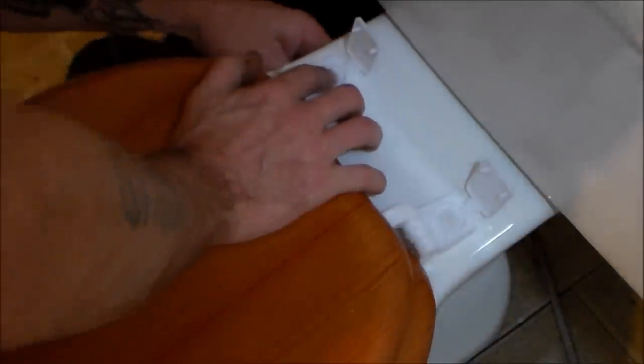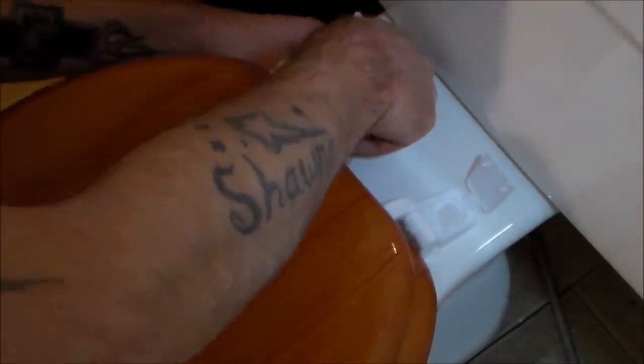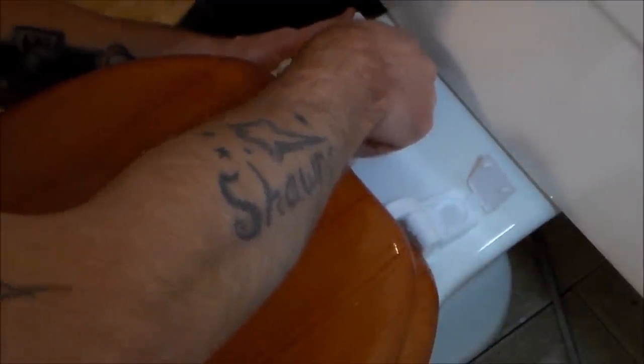The old toilet was too tall — it's made for handicap use, which might be why it was in the basement. We can't find the lid to the tank, so we've got to get one. Just kind of move the seat around until it's a nice fit, then go ahead and tighten it up. I just use a screwdriver and my fingers — you twist the nut up underneath and just hold it with the screwdriver, tighten with your fingers, then flip your little flaps down.